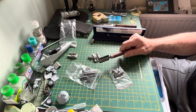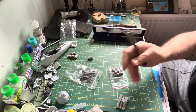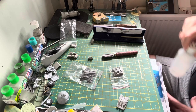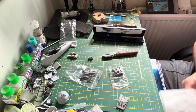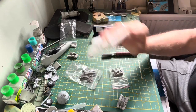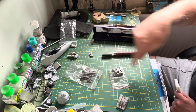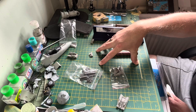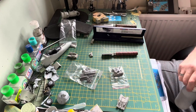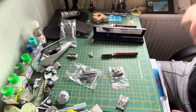Once you've finished taking all the lugs off, put everything to one side. Get all your cut bits into one box and the lugs can go straight in the bin. Then what I normally do is drizzle some IPA all over the actual desk itself and with a piece of kitchen roll just wipe around, keeping the airborne particles to a minimum. Once that's done, clean it all up. You'll have particles on the mat itself too, so do another round with a clean cloth to get everything off.